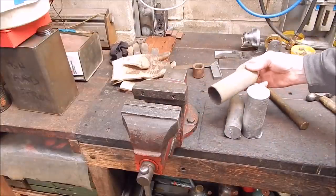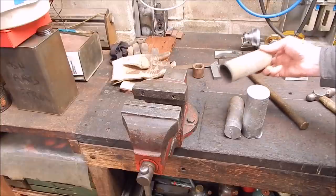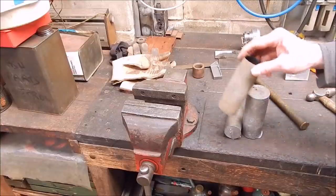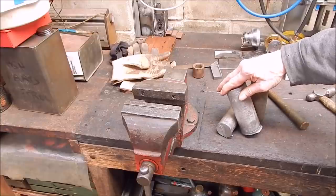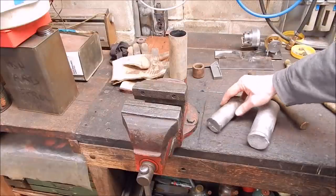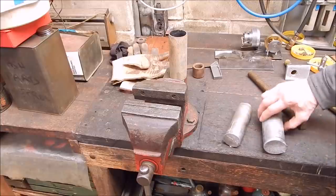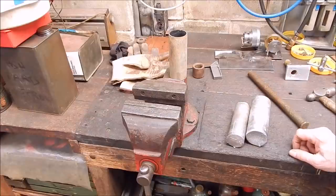Always preheat the mould, okay? And then everything will be good. It won't chill the aluminium too quickly. And you can always tell when it's been chilled too quickly. It'll always have a rough, uneven outside surface. But as you can see, both of these are first class, really, as far as this goes. And yeah, so, easy peasy, but play safe.